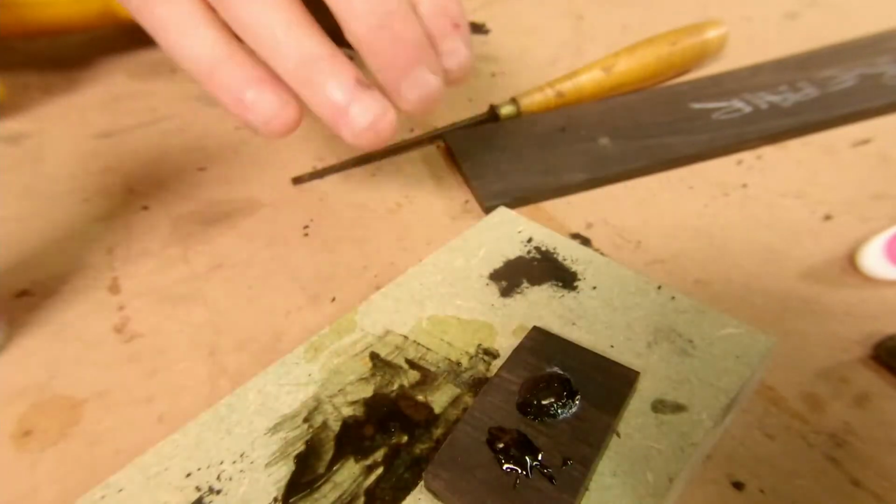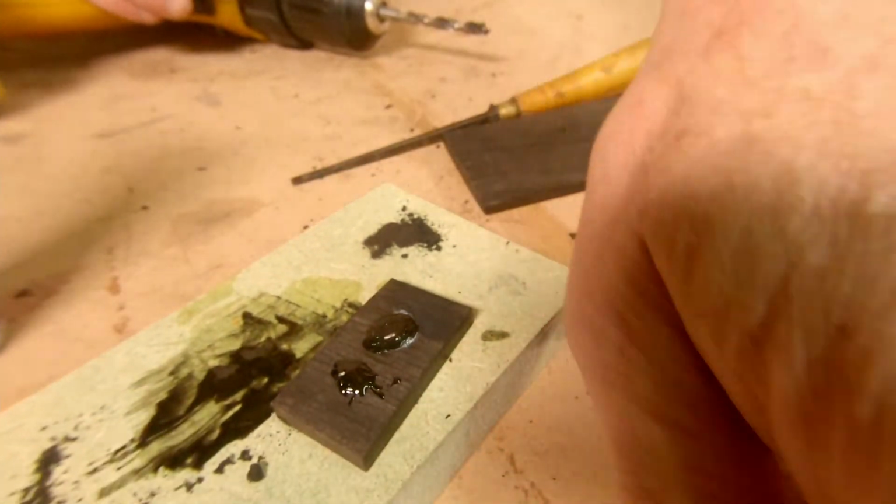Carly in Australia said that she wants to make an electric with burl wood and epoxy. Have you got anything to say about using burl wood? Yeah, well, that's the way to go. Obviously, you need to fill all those holes. With that kind of wood, you normally wouldn't be putting a stain on anyway. And there are ways to apply a stain. You could spray it on rather than rag it on into the wood. You could seal the surface first and then apply a stain. What I was getting at is if you were trying to stain the bare wood.